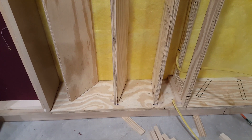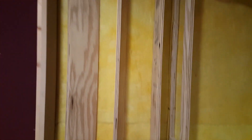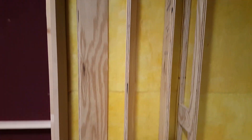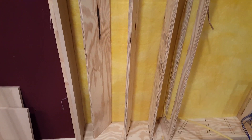We've put the waveguides in along the guides that we've created and just brad-nailed them in. They just need to stay in place. The waveguides are 7 inches wide, made of plywood like just about everything else.